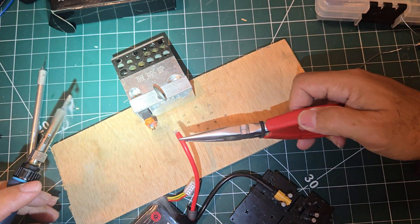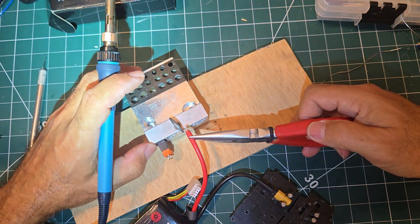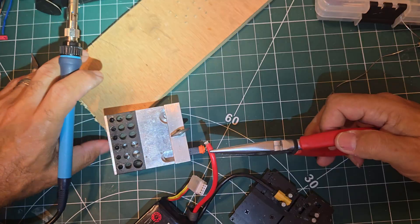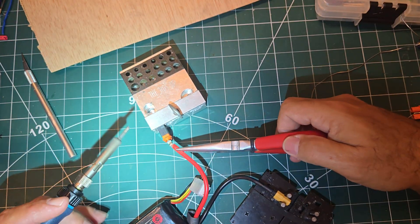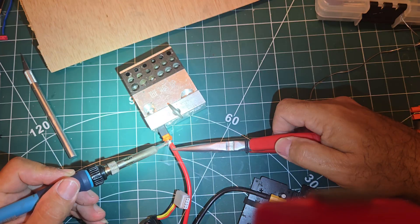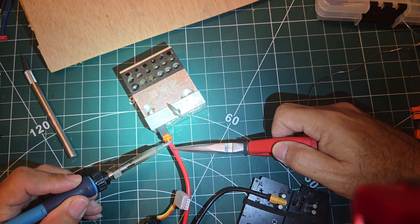Now it came out. I set the iron in the holder, still maintaining control of the red wire. I turn the plug around in the jig to get to the other side. Rather than being tempted to take both wires off at once, just leave the black wire connected — you don't have to worry about them touching because there's heat shrink on it. I clean my tip again, put just a little bit of flux on there to promote heating, and grab the wire so I'm ready to work.